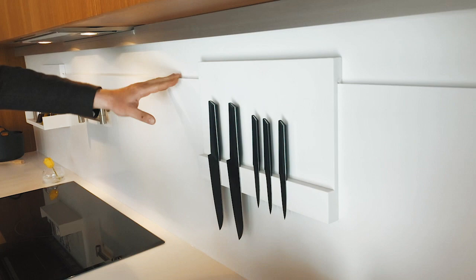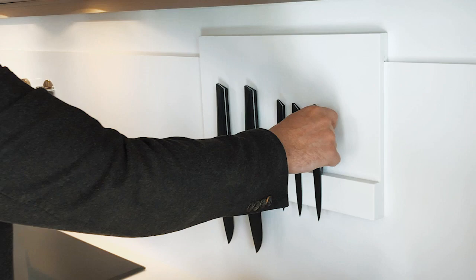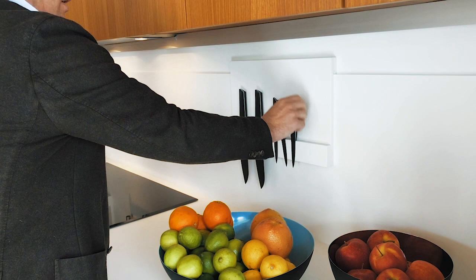What we did here is run the piece of Corian up quite high on the wall, put a little French cleat at the top, and this allowed us to create different little elements that could be installed on top of it, removed for cleaning, or repositioned for convenience.